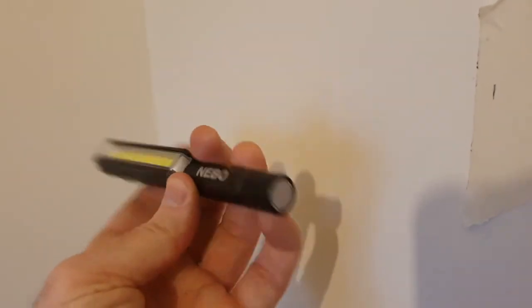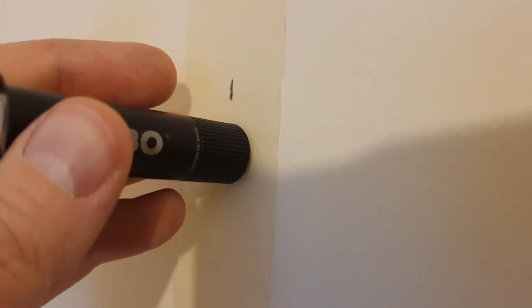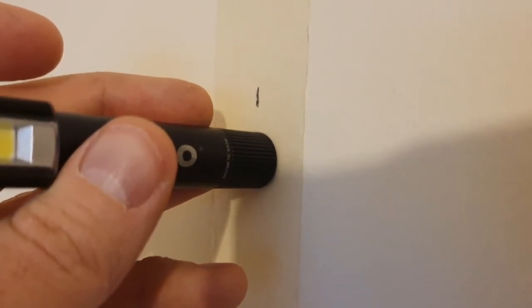This is the magnet on the bottom of the torch. You can't see it on camera but I can feel the magnet pull at that point. It's not as strong as the neodymium magnet, but it works. Continue on down the length of the wall and then try 400 millimeters again to the next stud. You can also skip the tape and just go back and forth slowly until you feel the pull — you will need a strong magnet.